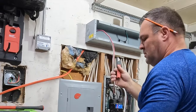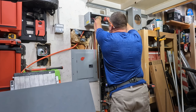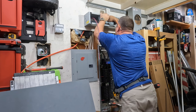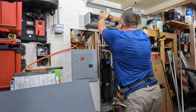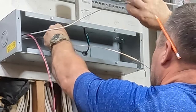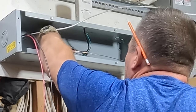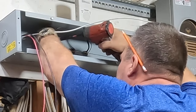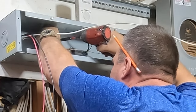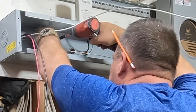This wire is 10-3, and with 10 wire you're able to get the full 30 amps at 240 volts, which will give you a portable generator connection good for 7,200 watts — that's 7.2 kilowatts. It's simple Ohm's Law math: 30 times 240 volts gives you 7,200 watts of available electrical power from your portable generator.